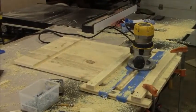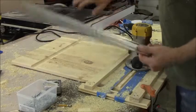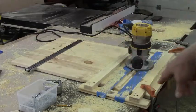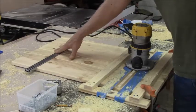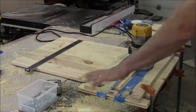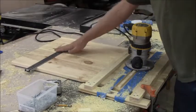I've been a little busy but I wanted to show what I was up to today. I'm making the grooves for my tracks — drawer slides, full extension — that I'm making the recess for with my router. I built a jig just very similar to the one I showed before. The groove has to be one and seven-sixteenths wide, so I took the half-inch bit. This is six and fifteen-sixteenths apart, and I squared it up, put a bunch of screws in it, clamped it on the jig, set the depth, put the tape on here to stop chipping the edge of the wood — and it worked just absolutely marvelous.